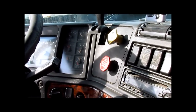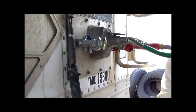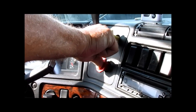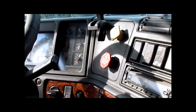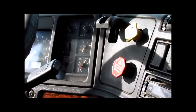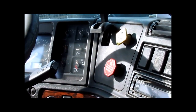I will now go outside and disconnect my service line — the blue line. Double check and make sure there is no air leaking from the red line when you are outside. Check your brakes. There is no air leaking from either glad hand. The service line is disconnected. There is no air leaking from either glad hand. Push in both tractor valves. Maximum air pressure. Shut the truck off. Make a firm hard brake application, holding it to the floor until the protection valve closes. The air is now leaking from the service line — it will leak until the protection valve closes. Must close no less than 20 PSI.